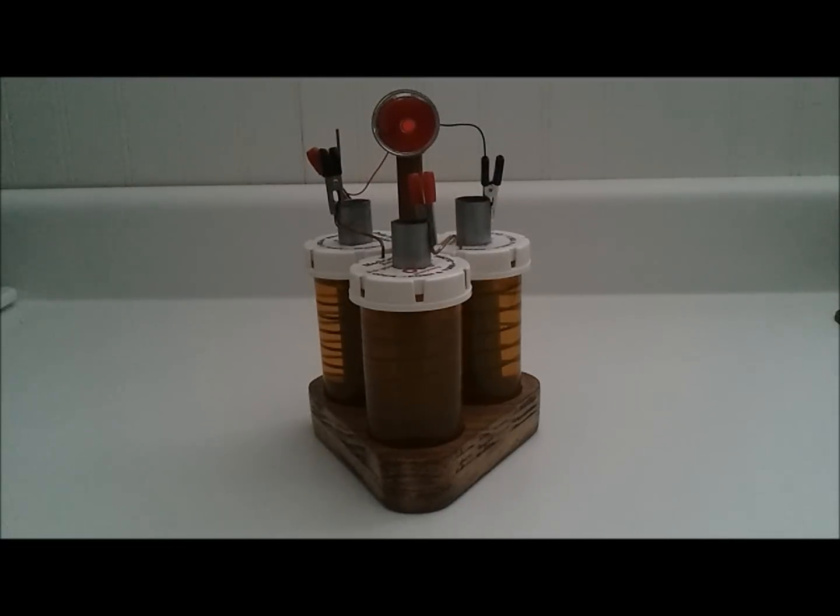This is just a little update on some of the batteries I've built and how they've been doing. This is one of the first batteries I ever made — three cells hooked in series. It's a water battery: galvanized steel conduit, copper wire, and tap water. The three cells in series are lighting that LED. In another month this setup will have been working for three and a half years. That's pretty cool.